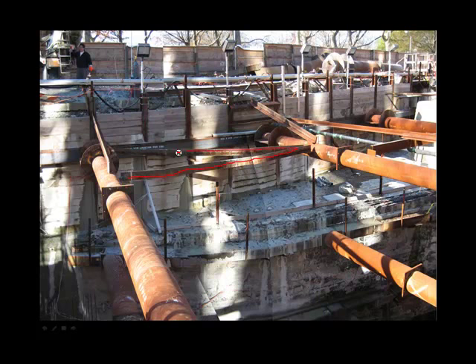I want to make note of all this diagonal bracing and incline bracing. The loads on the system are not at right angles to the struts, and there are lots of eccentric loads being applied, so this requires very careful analysis. The soldier piles here also are resting on the roof of an existing subway tunnel, so these soldier piles have to be installed with great care.